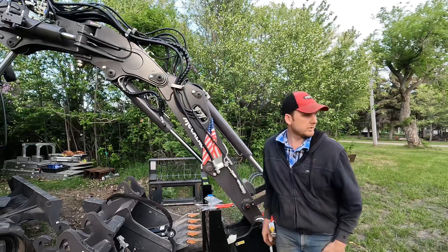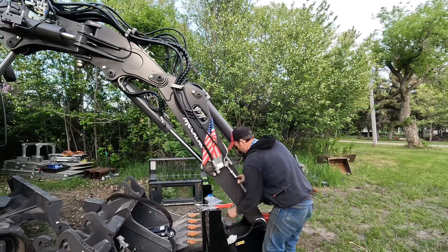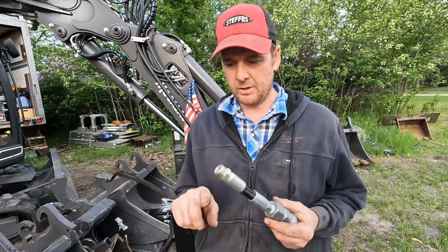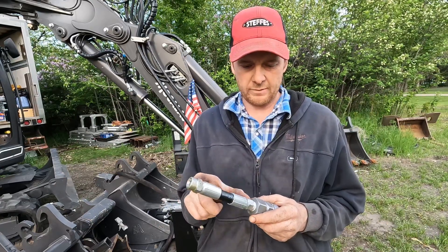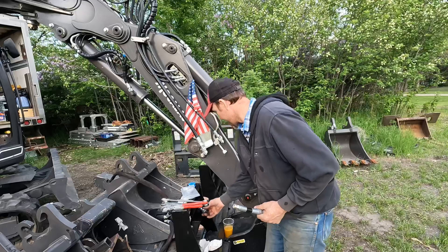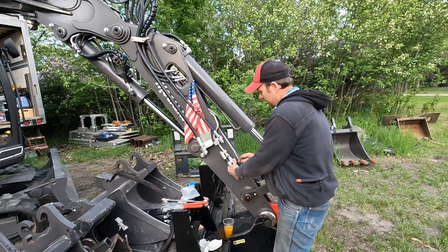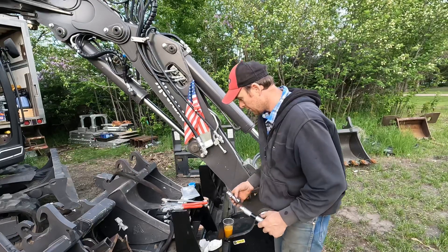Last time I did this it made a mess, so let's get a little carton this time. RDO made me up this piece that went from the DIN 24mm 1.5 to a half-inch national pipe thread. But it was a lot longer than I wanted — it used to sit right here, and now it's sitting way down here. And then my hoses, when they came up, bent around a lot further to get in. So I wanted to shorten that.